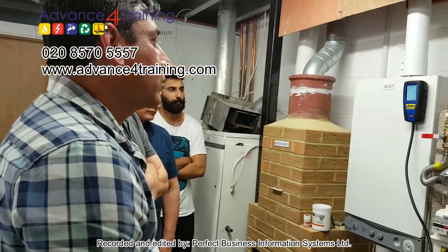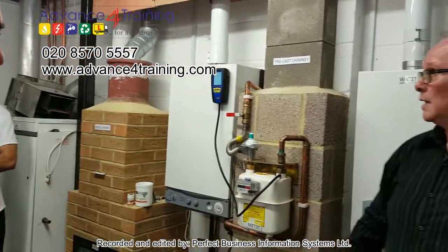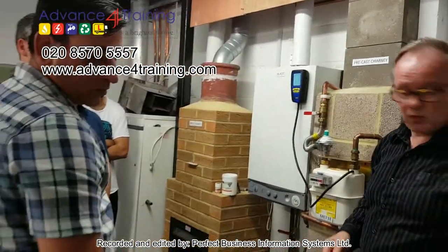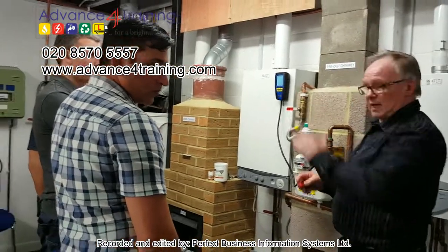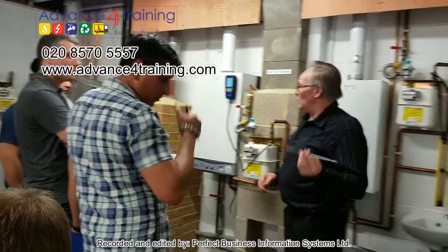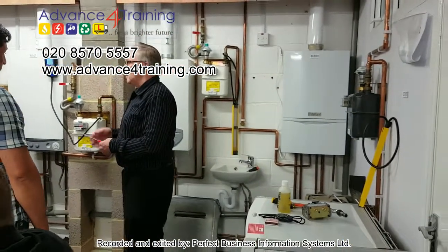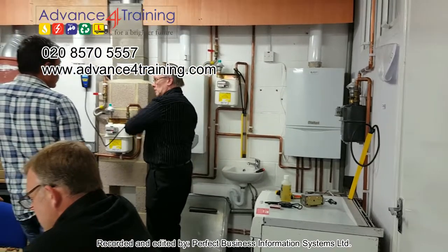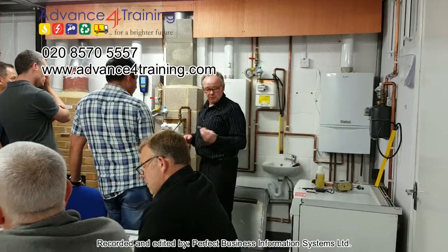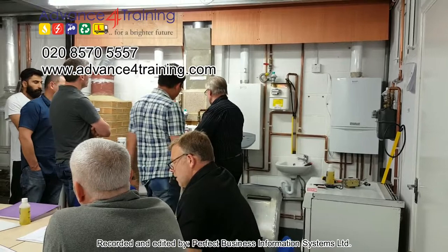Don't forget, if you're going to do this and it's connected, you must open that lid there. You need to check what appliances you've got. If there's a cooker with a lid like that, otherwise it acts as a safety valve and shuts off the gas to all the taps — so that's not being checked. Even if there was a leak, the first thing you do is start looking at appliances, isolate them down one at a time, and if the pressure stops dropping, then you know that's probably what your problem is.